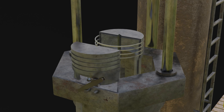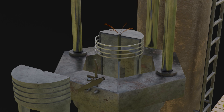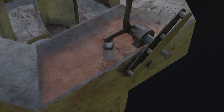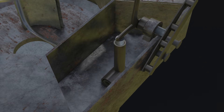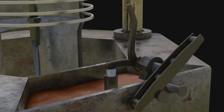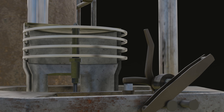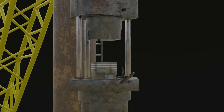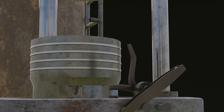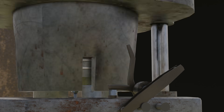Next, the fuel system. The fuel is injected through an injector located in the middle of the piston. To make diesel fuel injected, we need a high-pressure pump located inside the fuel tank — and this is the location of the fuel tank. The pump used is a piston-type pump. To pump it, we need to press a shaft, and to press the shaft there is a pump lever located on top of the pump. Uniquely, we don't need to pump this lever manually, because next to the iron block there's a bar that, when it goes down, will touch the lever and press the pump spontaneously. This mechanism causes diesel fuel to be pumped and sprayed out through the injector.